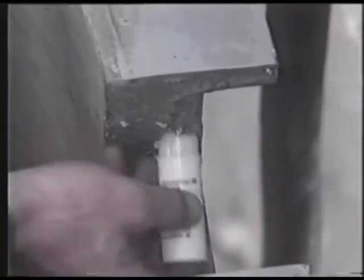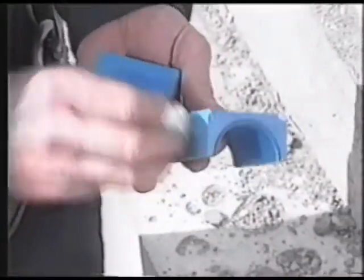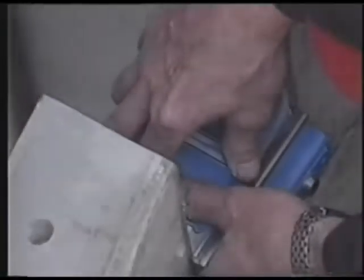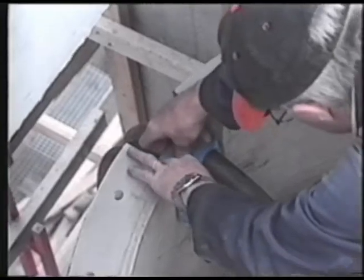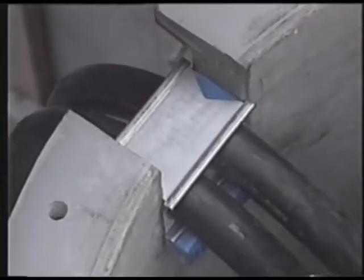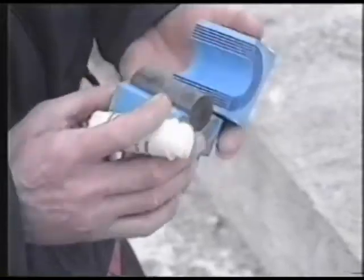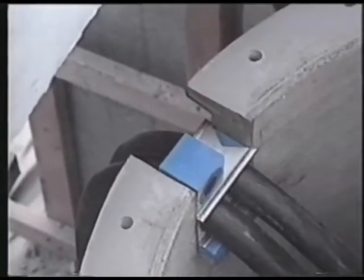Back to Norway and the glass fiber installation, where the frame is a part of the tube. Grease the inside and the outside of the lower parts of the modules and put them in place. Put the power cables in position. Grease the other halves of the modules and put them in place. Mount the next stay plate. In this case, one module will be without cable — grease the plug and the inside and outside of the module and put it in place. And finally, the auxiliary cable.